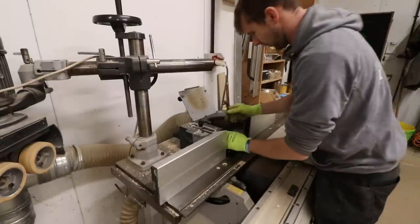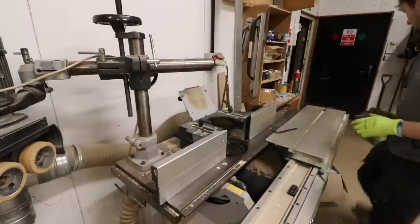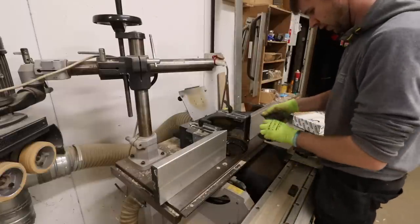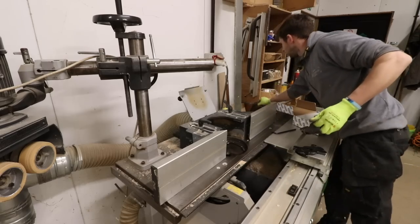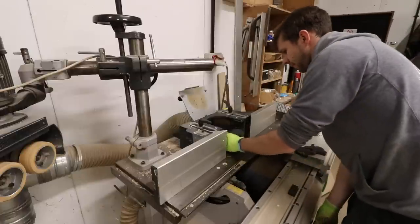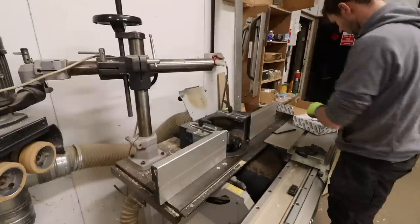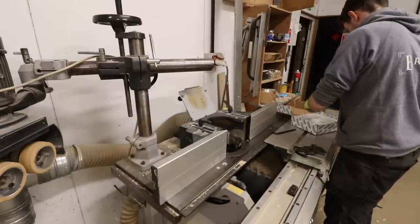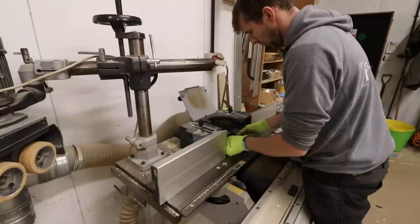Kind of filming this a bit like a vlog, so I haven't got an awful lot of time to be messing about prepping for camera shots and stuff. We'll start at 15 with this one, with no spacers. So, let's put a ring in the bed so we've got a bit more support. Raise that up. We start at 15, let's put 3mm into it and see what we end up with, see how close to 18 it is. We'll make the adjustment from there.